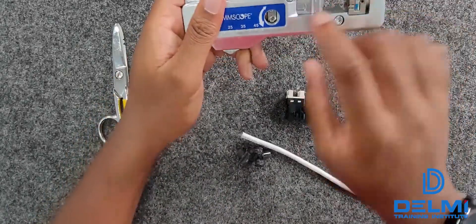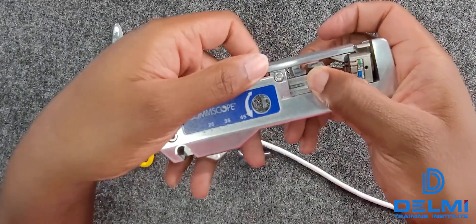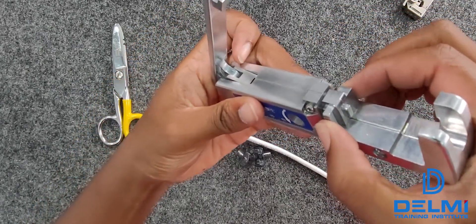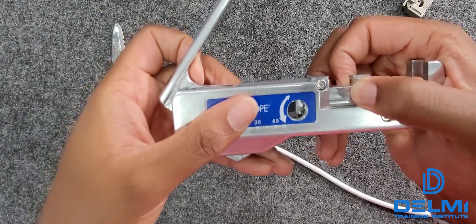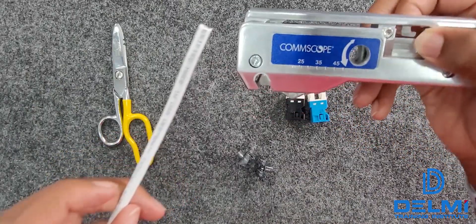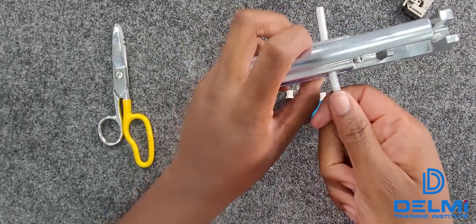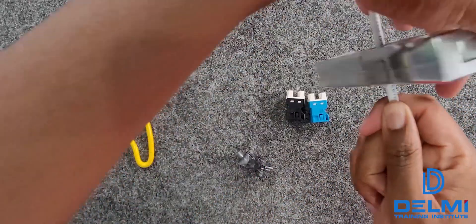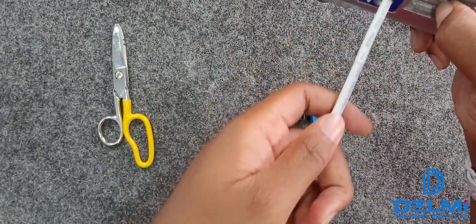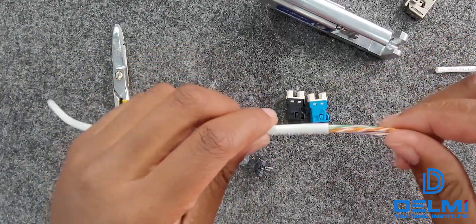With this device you can use it to strip your cable. To access it, you pull this up — it will lift up and you can take this off. Then you pull this piece over here and as you pull it, it opens up the scoring place. You can see there's a blade there to score your cable. Open it up with your index finger and thumb, place the cable in, release, and spin it around at least once or twice. Then pull the cable out and your cable has been stripped.